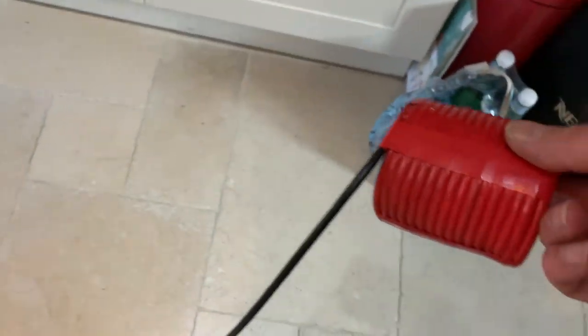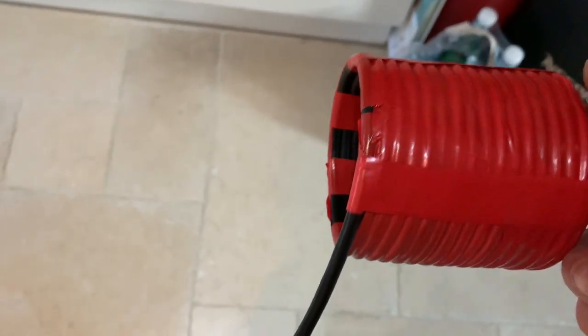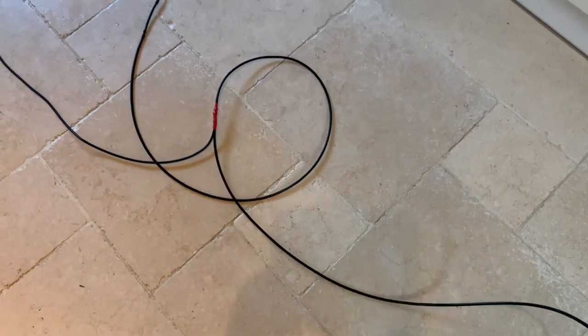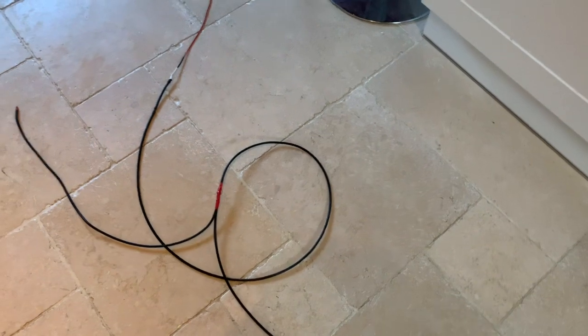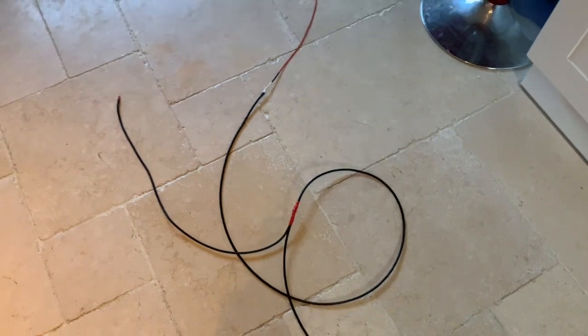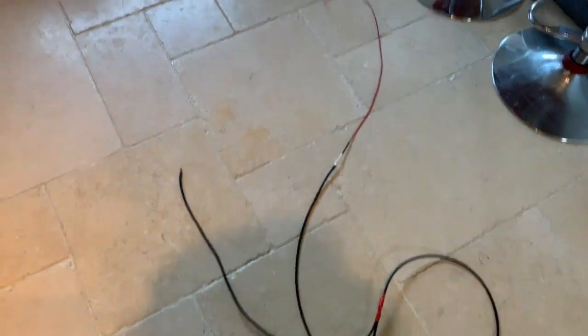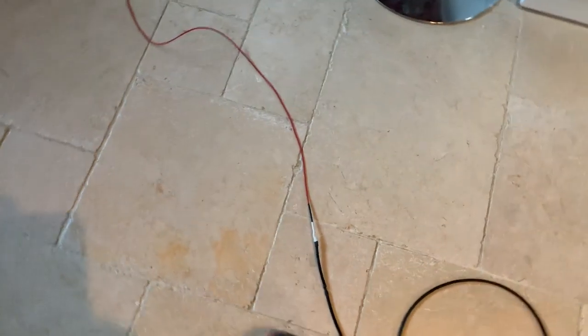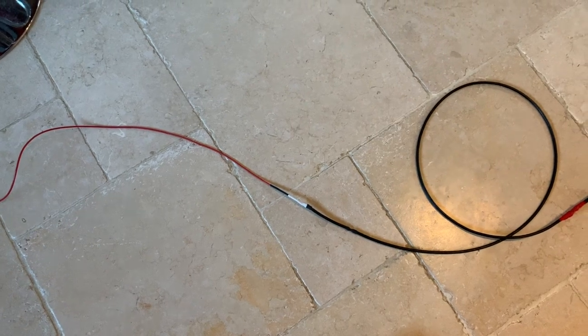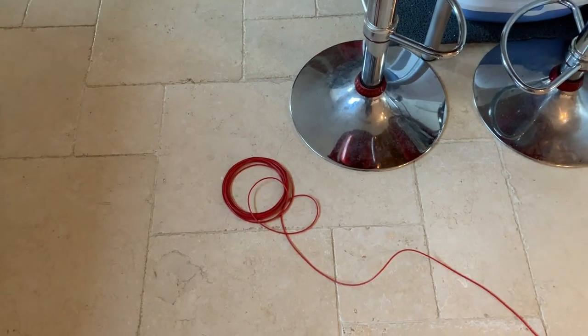So what we've got now is our antenna, which is basically this choke with the lower part of the 5/8 wave, which is what this is for CB frequencies, with a matching stub. And then we have a capacitor which is made up of the coax, and then 3 meters, or 3.8 meters, of driving element. So you've basically got a dipole.